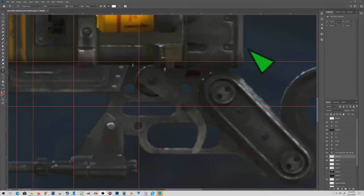We're starting today's build by taking a look in Photoshop at the trigger mechanism itself. Being a sci-fi weapon, this point here is probably the pivot point of the trigger. So you pull the trigger back here and this part up here gets moved forward. I'm going to hide the switch up here so that just the tiny metal part is visible. When I pull the trigger, it'll move this piece down, restrained a little bit by a spring — so you'll need a small spring — which will break the connection to the switch. This will cause the Arduino pin to go high because of the pull-up resistor, and I can use that logic in reverse to determine that the weapon is being fired.